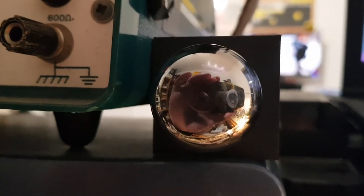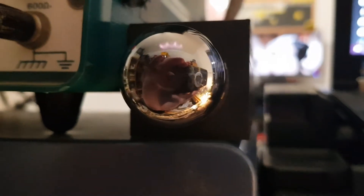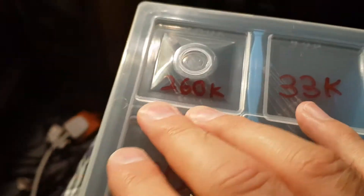I used Mike's electric circuit, which I'll put a link to in the description. Only instead of the 820K resistor, this one needed a lot lower. Everything else was the same, apart from the capacitors are all 250V rated, because I didn't have any higher.